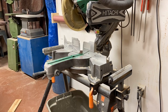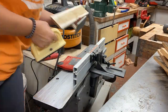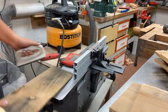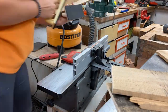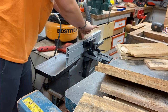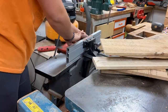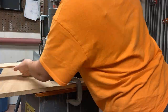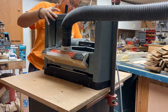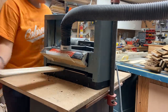I took more here than I needed, but I wasn't sure how much I was going to need overall because I was going to be making a certain amount of ornaments. After I cut all of the nails off, I try and flatten one side to prepare it for the planer. I use my 6-inch or 8-inch jointer — it's really nice. Sometimes the boards are too wide, so I just throw them through the planer instead of jointing one side. But once one side's jointed, I do one of the thinner sides so I can put it down and cut the edges off on the table saw once it's actually flattened. When I plane each board down for this project, I'm planing them down to about an eighth of an inch thick because that's how thick I want each ornament to be, but I don't do that with every board because I know I won't need every single board I'll be planing down.